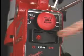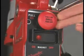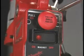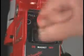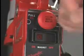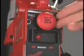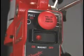Line lockout prevents the drill from starting when power is first applied or after a power loss. Reset the tool by turning off the drill and magnet. The motor-magnet interlock prevents power from being applied to the motor if the magnet is not energized. It also prevents the magnet from being de-energized while the motor is running.